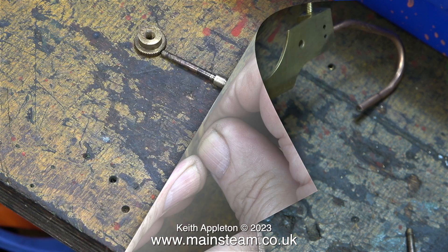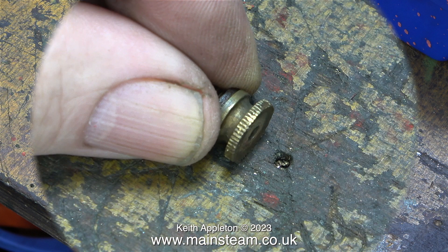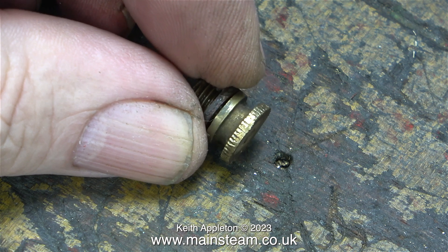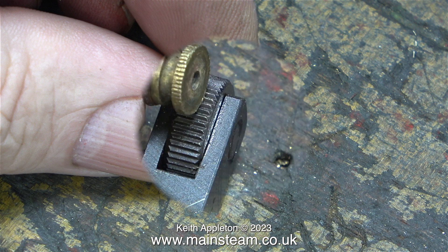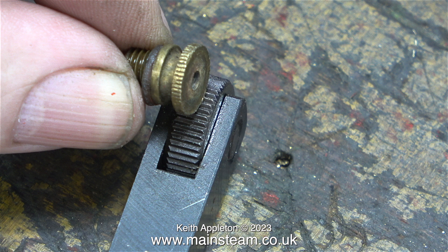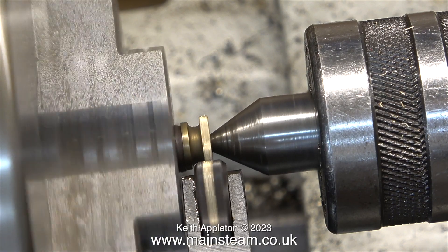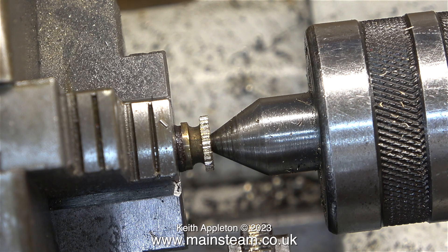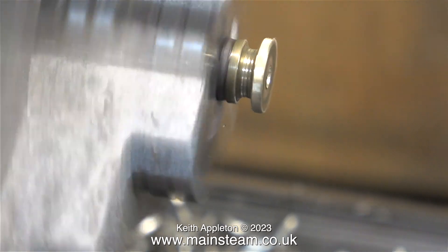For now I want a closer look at this safety valve. This is an exploded view of the parts, including a part on the left that is not part of the safety valve. The real safety valve part has very badly damaged knurling — most likely from using pliers to remove it. I'm going to attempt to re-knurl it first. The knurls on my knurling tool are a bit big and I don't think this is going to work. I held the part in the chuck by the threads gently but firmly, used a live centre to hold it in position, then touched it very gently with the knurling tool. Now it looks fairly horrible and very sharp on the edges. The answer is to use a needle file on the inside edge and a full-size file on the outside edge.